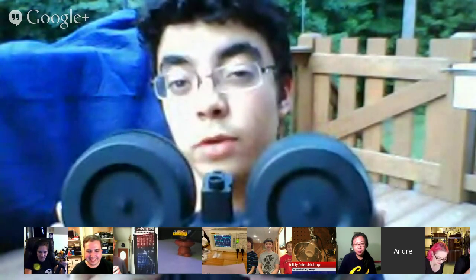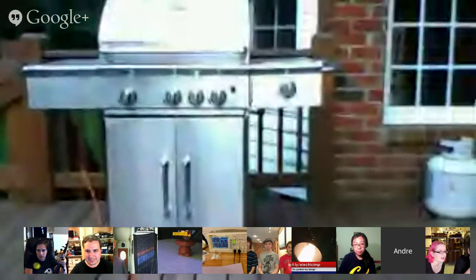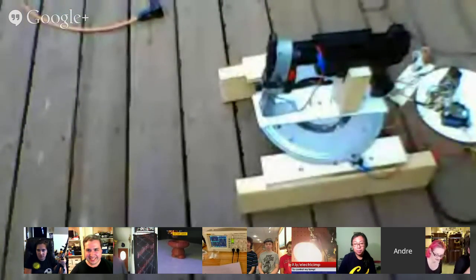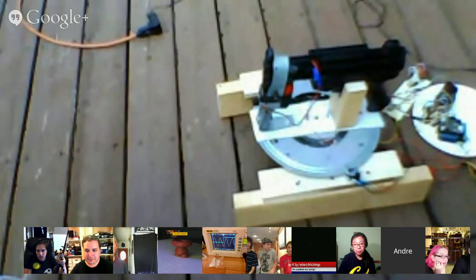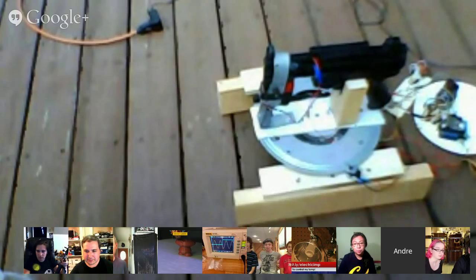Next is Andre. So I was inspired by a video to build an airsoft turret. This magazine holds 2,500 rounds. I have a window motor below the turret that drives it, and two switches that tell it to reverse direction. Then I have a relay that connects the battery to the trigger — which I forgot to zip-tie down. I also have a sonar sensor duct-taped to the front, which detects distance and fires if something is within 100 centimeters.